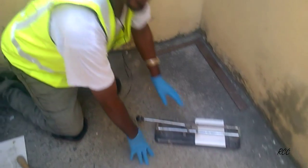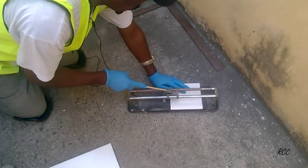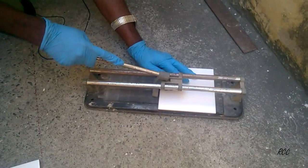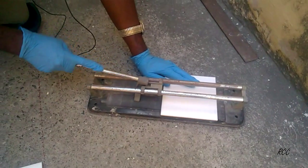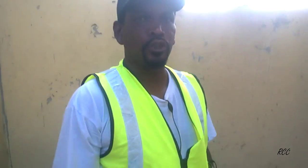Your tile cutter is used to cut your tile, giving straight cuts. There's a diamond blade in it — you press the diamond blade down and push it up, and once you push it up, the tile is cut. You don't need to do anything more than put some support on it and the tile breaks to where you want it.